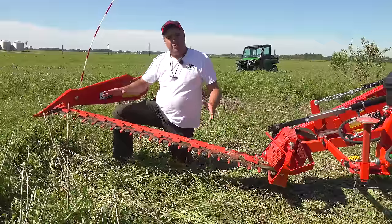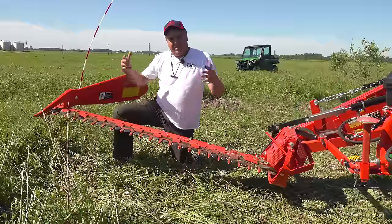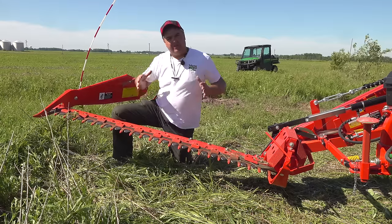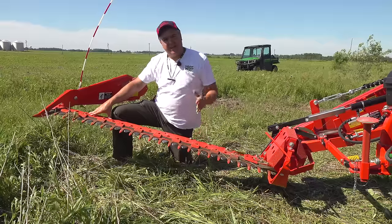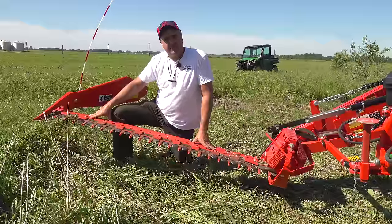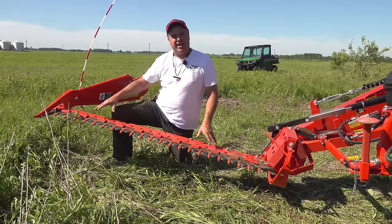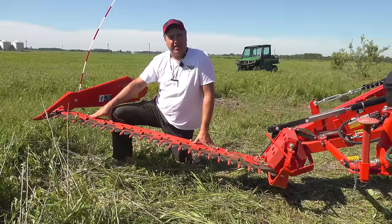The way they handle it is they mow the hay one day and let it dry. The next day they use a tedder to stir it all up and let it dry one more day. Then they use a rake to push it into windrows, and with those windrows we can run a baler right along there and bale that up — usually on the third day. These sickle bar mowers are very simple, less expensive than a disc mower, lightweight, and easy to handle for a small tractor. It's an interesting combination that's maybe coming back into style as more compact and subcompact tractors are used for haymaking.